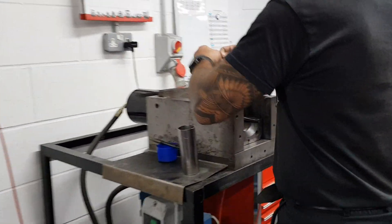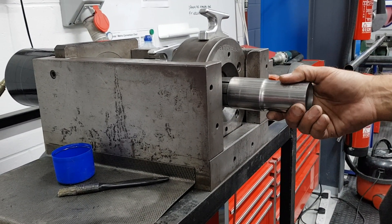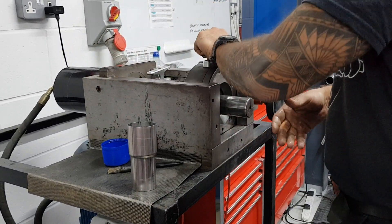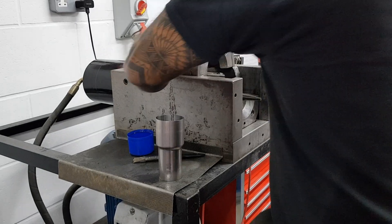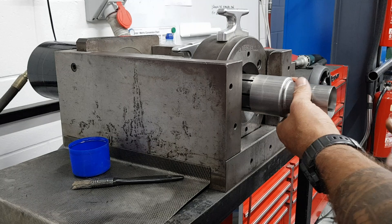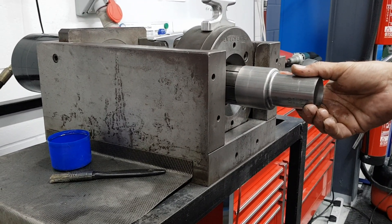We've put in our first tool. Just got a little bit of lube to go round on the inside of the tube. Take that one straight up, change to the next tool, and the next one. I've lubed all these tools beforehand just to help the tube slide. If you've got good quality tube, it should expand quite considerably without cracking.